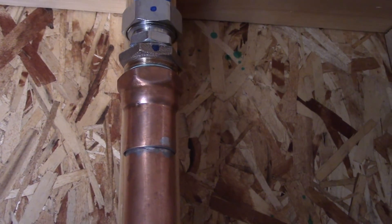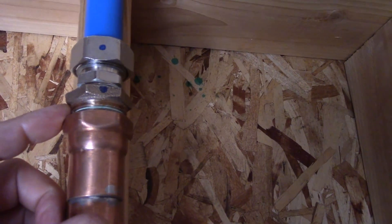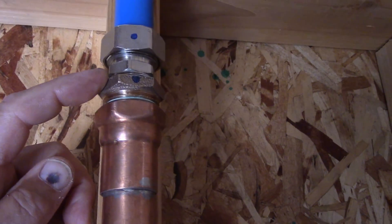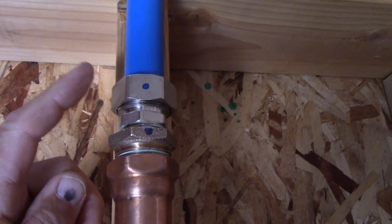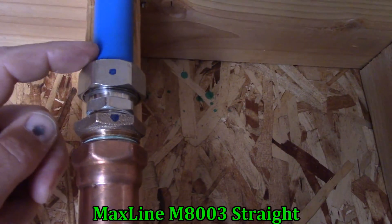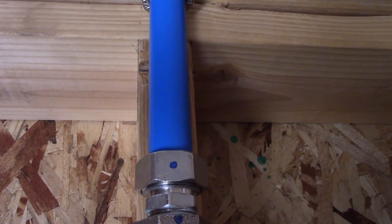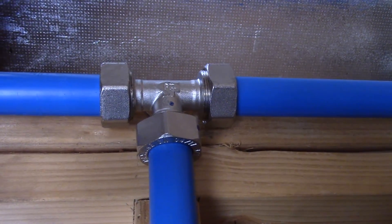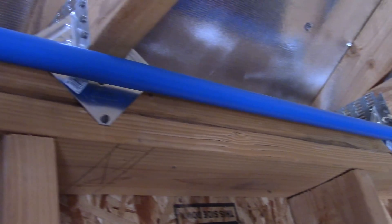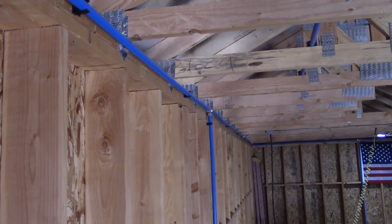This is my one-inch outlet from the regulator. I already had one inch so I just used it. What you see here is copper with a one inch to three-quarter inch national pipe taper adapter into this fitting provided, and then it goes to the RapidAir three-quarter inch MaxLine fitting. Then I have it up to a T — a three-quarter inch T — which runs the entire loop. There's my first drop and I'll bring you in closer for that.